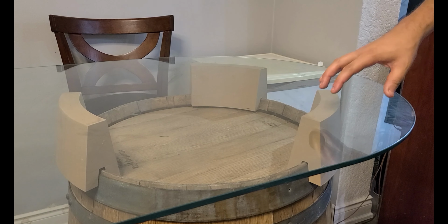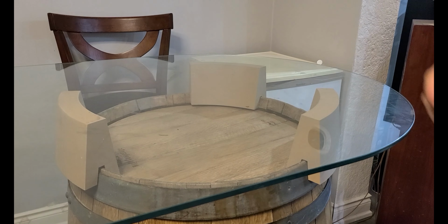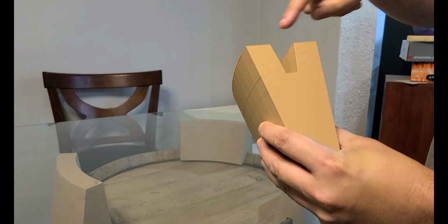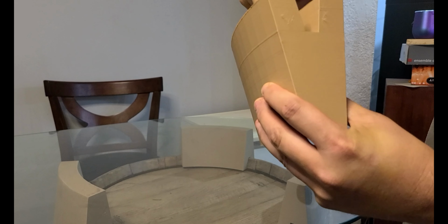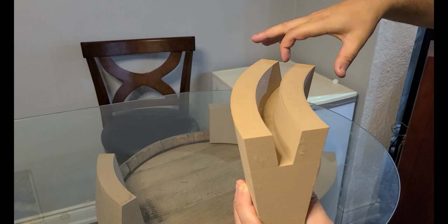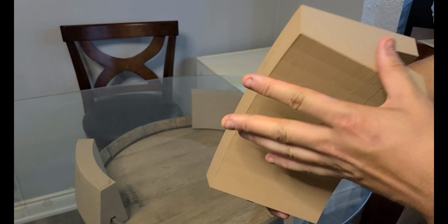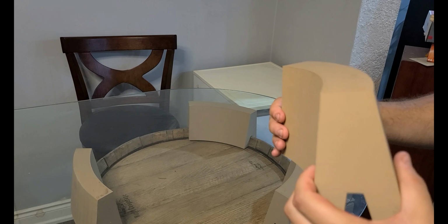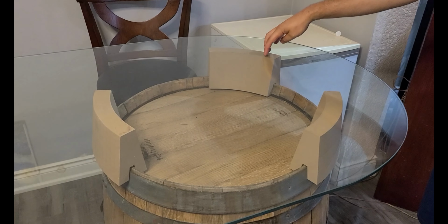So what I did is I took calipers and I measured the top and I measured the bottom of this. And then I got the top width and the bottom width, and then I made a little diagram, made everything symmetrical. And then in SolidWorks, I was able to take this and extrude out from that along the length in a circle, along an arc, right? And then that's what created this 3D object, basically. I made this A shape and then pushed it out. And then that's what I put into my printer, and now it gave us these things that have a pretty nice snug fit.